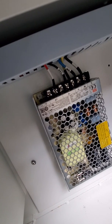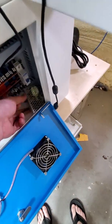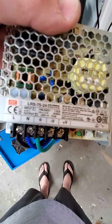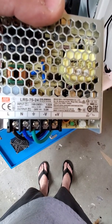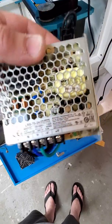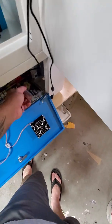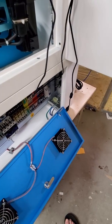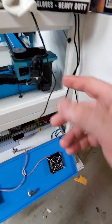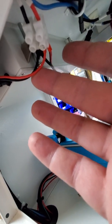What I did to fix that is — here is your new Meanwell power supply, 6.5-amp 24-volt. It's got a spare set of lugs so you can use them at a later date for whatever else runs on 24 volts — more lights or what have you. This replaced the little stock unit, which outputs only 3.2 amps at 24 volts. This stock unit just has enough power to power the machine for its 24-volt setup, which is why I switched to the larger, more powerful box. From the power supply it runs through the normal circuitry, and then I've tied into one of the lights on the side and into the power supply for those lights, running power down and around to the switch.